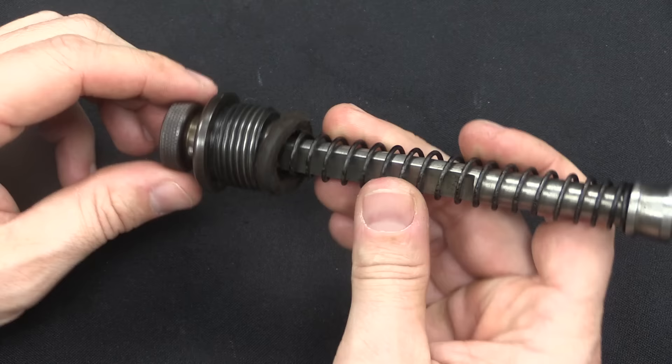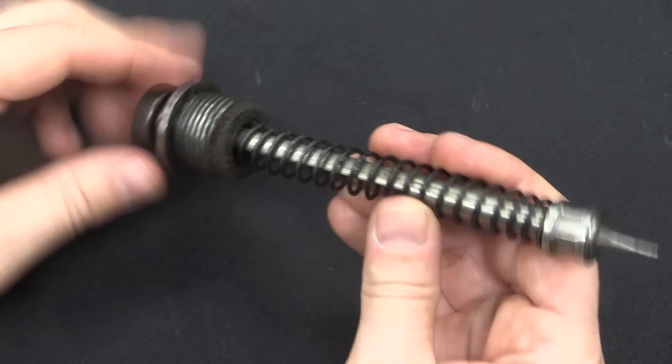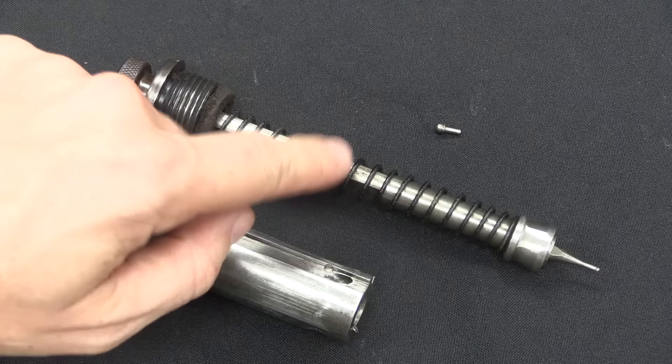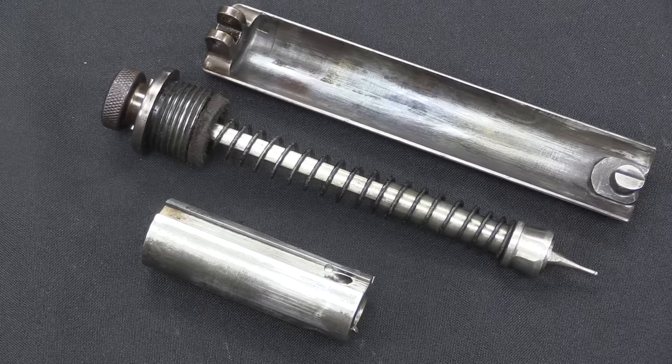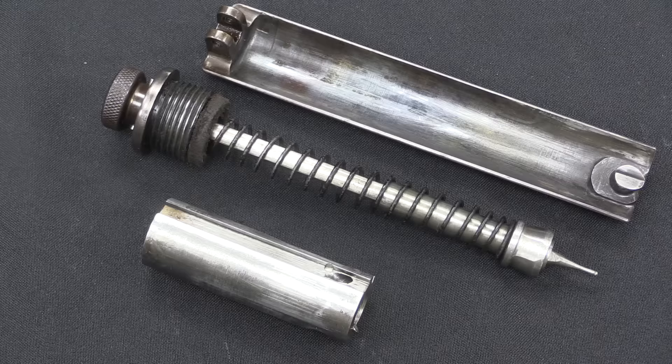Note that there is a leather buffer pad in the .455 version — that's not present in either of the other two examples of the Silverman pistols — but presumably necessary to help cushion the blow. The big downfall of the Maxim Silverman pistol is that it's a simple blowback gun. When you fire, this all cycles backward with inertia, and the spring and the weight of all the moving components are the only things to delay the opening of the breech — and it's not really enough. On the smaller-calibre pistols, the one in Borchardt calibre and the one basically necked up to 8.5mm, they had to add gas vent holes for safety and hesitation delaying springs to the back of the receiver. They never did that to the .455, possibly because the weight of the components was enough, or they just didn't get around to it. The gun was fundamentally chambered for a cartridge that was too powerful for its simple operating mechanism.